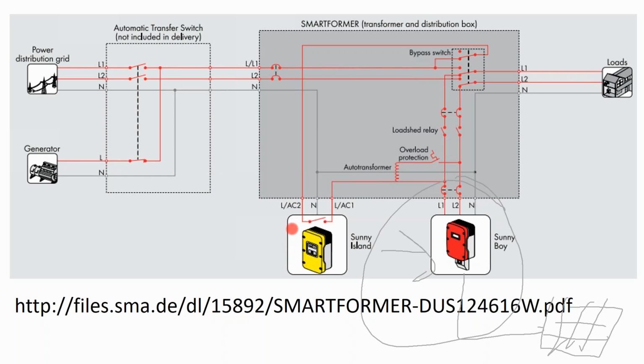And so what your battery inverter will do is shift the frequency of your electricity from 60 hertz to 58 hertz. And that'll trigger the shut-off protection in the solar inverter, independent of what manufacturer it is. And so you can just get the cheapest solar inverter that's batteryless today and then add a battery inverter of a different manufacturer tomorrow and they'll be compatible. But what that means is there's going to be times when you're turning off your array and then cycling your battery down and then recharging that battery back up.